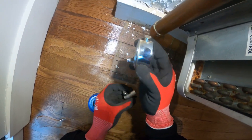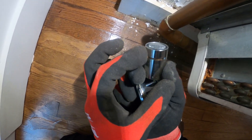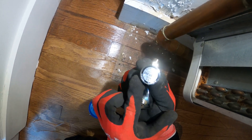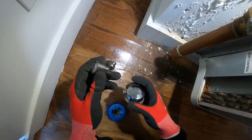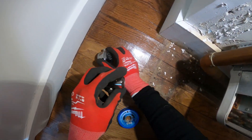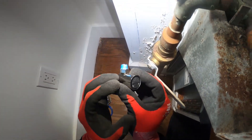Here's the old air vent valve and here's the new one I'm replacing it with. This one is adjustable — there's a little lever, and depending on how open or closed you have it, it allows a certain amount of air through. Facing left is fully open, this way is fully closed. Always make sure it's rated for the floor you're on. I'm wrapping some Teflon tape around the threads before tightening it on.